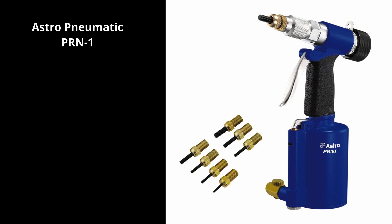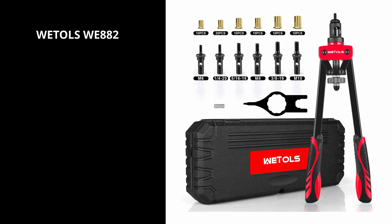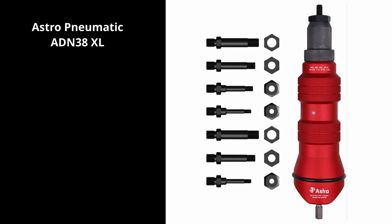Aside from what I showed you, there are some other tools out there. There's a pneumatic type tool that uses air pressure to do the job for you. There's also a heavy-duty type that takes two hands, made for larger Nutserts starting with maybe a quarter-inch and going bigger. And finally, there's the drill type, which is intended to work on the end of your drill — hook it up, get everything secured, pull the trigger and it'll tighten everything down. That works with both electronic drills or any impact that takes a quarter-inch hex bit.